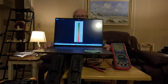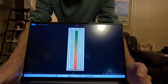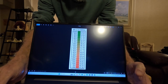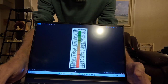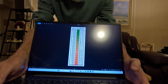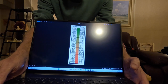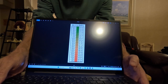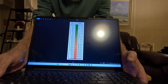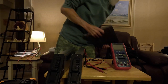We have some recommended voltage settings here. 100% is 54.6V, 80% is 51.0V, and 30% is 46.6V. 80% is the recommended storage level for all kinds of lithium-ion batteries — if you're not going to use them for a long time, charge them to 80% and you can safely leave them. At 30%, you really want to charge them back up at that point.